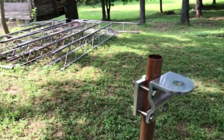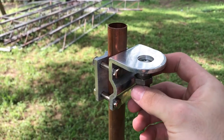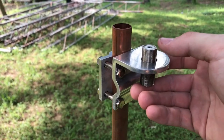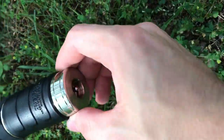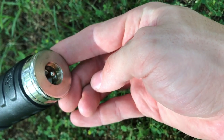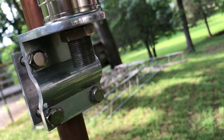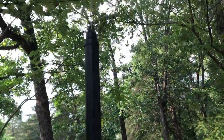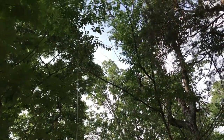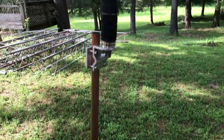Now that I've got this connected, I have this bulkhead SO-239 that I'm just going to slide up through here, and then the antenna will screw on top of that. If you look at the bottom of this antenna, it has that style connection, so we'll just screw that on there and it should be firmly mounted. Just like that, we've got the nut mounted on there — this is firmly on there and we have our ATAS-120 Yaesu antenna just kind of set in the umbrella stand right there.